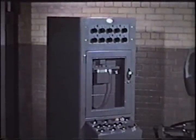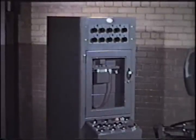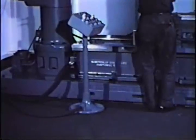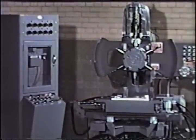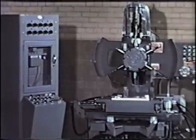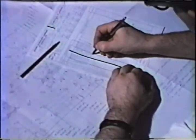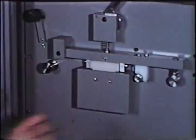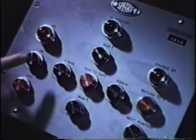What does the Sperry Control consist of? A cabinet occupying only three square feet of floor space, which contains a tape reader that can be operated either from a panel on the front of the cabinet or from a portable, remote-controlled pedestal, adjustable to height. Designed to a point of maximum economy, the operational requirements of this new control have been simplified to four essential steps: the transfer of dimensional information from a drawing to a worksheet; the transfer of information from the worksheet to a tape; the insertion of the tape into the tape reader; and the pressing of a button on the control panel.